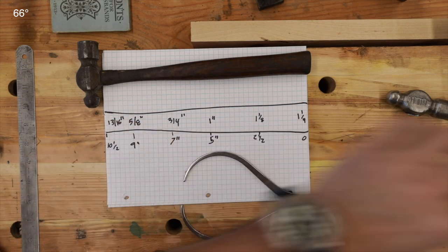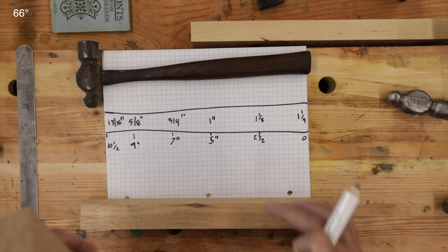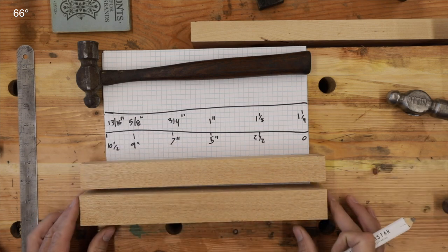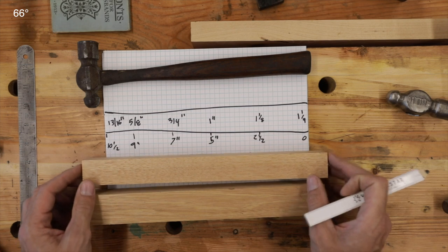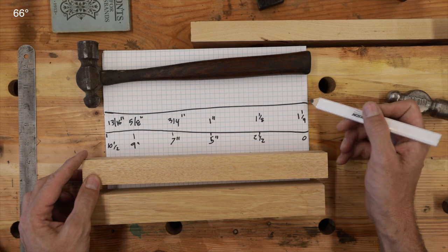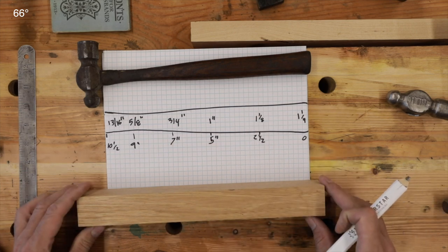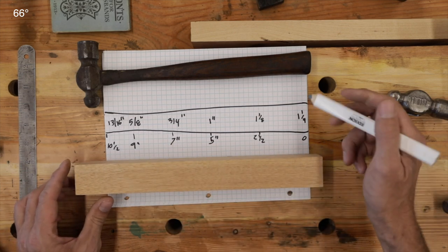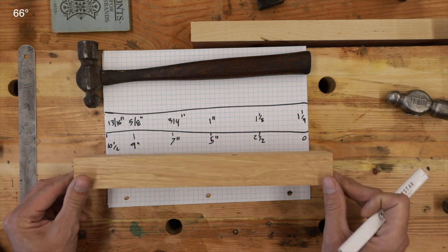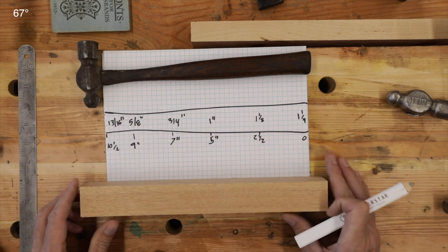So I'm hoping to put this on the lathe, set the caliper deals to the thickness we want, and measure these out as we go along. This is the billet we're going to use — I can't decide which one to start with. The widest portion of this handle is an inch and a quarter. I've ripped a billet of hickory at an inch and a quarter and a second one at an inch and a half. If we do inch and a quarter, that's what we need to finish at — there won't be room to remove tool marks and sand it, so we should go over a quarter and start with the inch and a half. That gives us an eighth each side. We have this beautiful clear American hickory with a nice grain — a perfect billet.